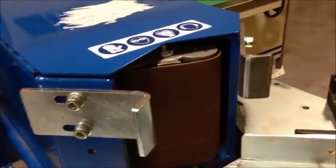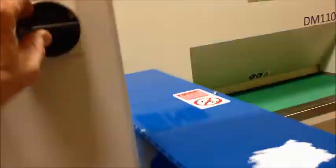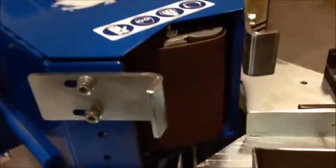so this is how you turn the machine on. At that point you get a white light. Now you can turn the belt on, turn it on with the delay. You pick your belt RPM, and then this is your oscillation. Turn the oscillation on, and that starts. These are your micro adjusters, so you can very finely adjust the in and out on both sides. Then